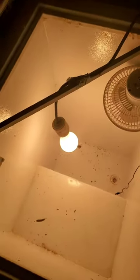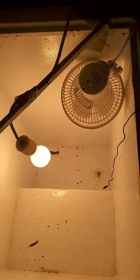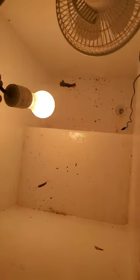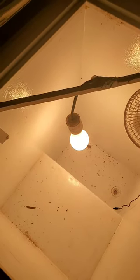I have an old deep freezer — one of those little cube freezers. That's a $15 fan from Dollar General and an old heat lamp, one of those little brooder lamps with a 200-watt bulb in it. This piece checks the temperature — just lay that in there. The fan keeps my incubator from getting cold pockets and makes sure I have good airflow, so there will be no cold or hot spots in this incubator.